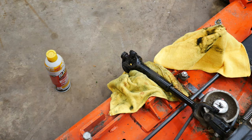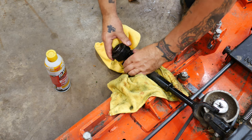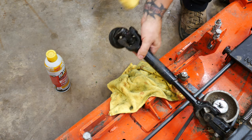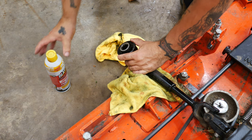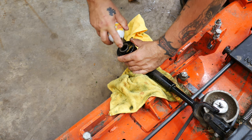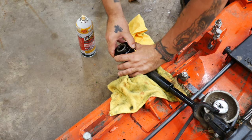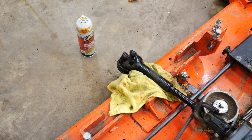I want to point out this pretty important piece. This connects to the spline by this collar coming back and locking in. I really wish they had a standard push button like on other PTO shafts — it would make things a lot easier. I take special care not only to lubricate the shaft, but to get all the junk off the face of it and around the outside. Then I pull this back and use just a little bit of PB Blaster so it isn't so hard to move and work it in, so it's not so hard to actuate once you're underneath the tractor — it can be a real devil. So let's back the tractor up, take a measurement, and show you how much space you have without the 4x4 and then with the 4x4.